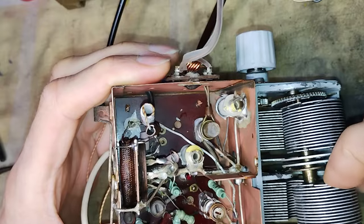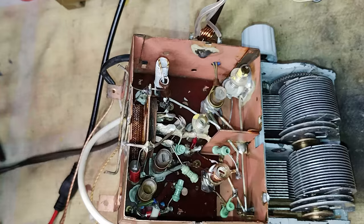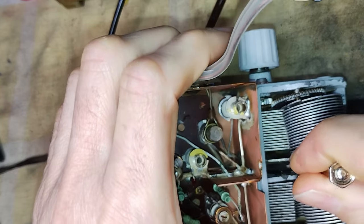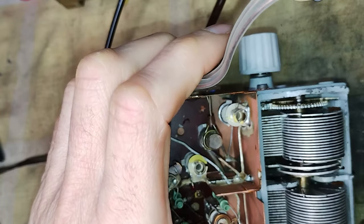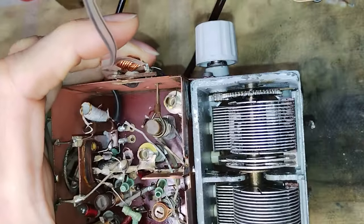These clips have been taken after the washing procedure, and they show how to remove the stator and how to put it back in place. Doing so is definitely not recommended, unless it is really needed for some reason. At this stage, the rotor blades were still shorting with the stator ones, and something else was tried out of desperation.